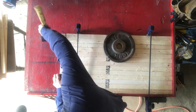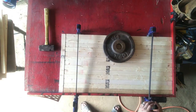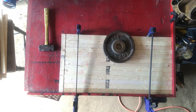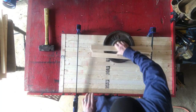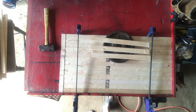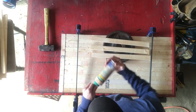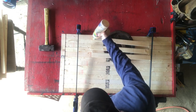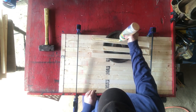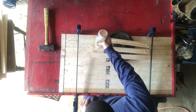If you don't have a 25-pound weight, have somebody sit on it — use something. Once you have it clamped down and ready to go, get three pieces for the support backing to hold it all together. The length for this one is 18 and 7/8 inches, depending on the width of your flag. I also use wood glue, and then I nail it down with 1¼-inch long ring nails.